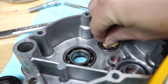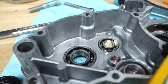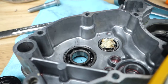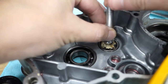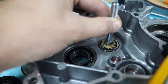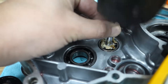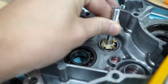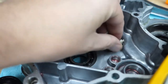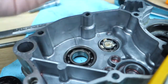We're going to pack it down into the center here, get as much as we can in there. Then we want to take something that's close to the inner race size — I've got this cap head — and we're going to drive it in. We're going to keep mashing more bread in there, hopefully using the pressure from the bread that's squeezing out to push the bearing up.